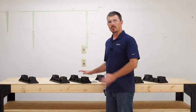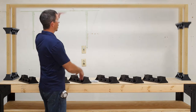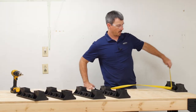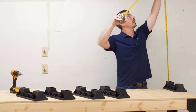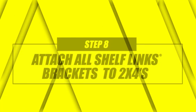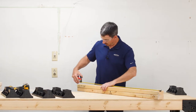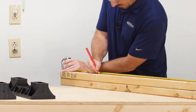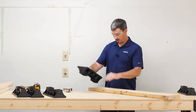With the shelf links, you can measure your space and configure it however you'd like. For us, we're going to attach it from one end to the other and create two shelves. We're going to measure for the height of our shelves — for this workbench we're going 48 inches for the top shelf, and we'll also do a shelf at 36 inches. Let's measure and mark that on both boards; that's going to be our placement for each shelf.